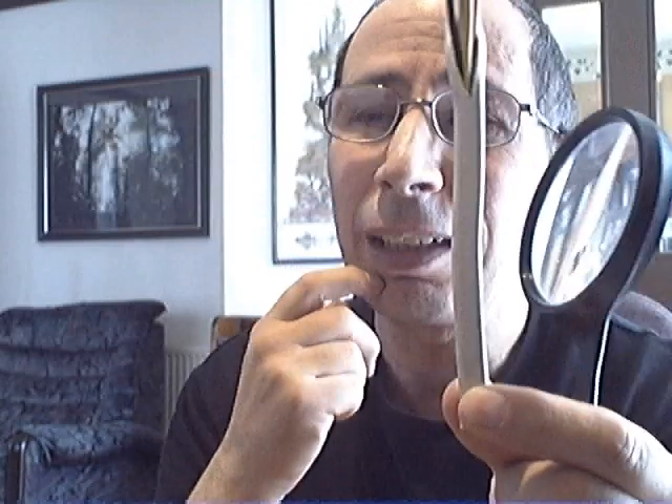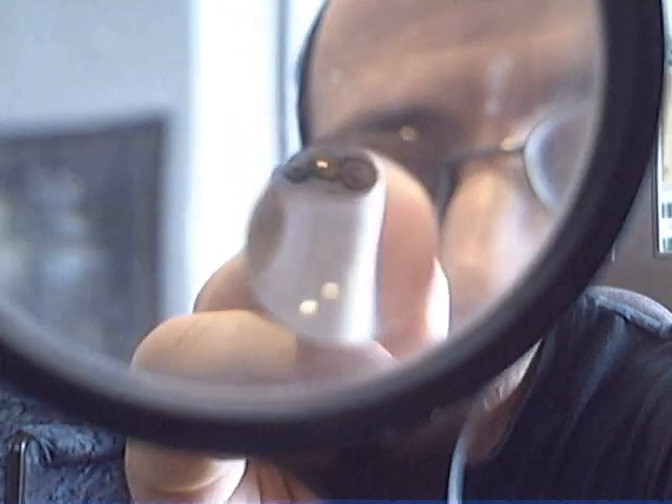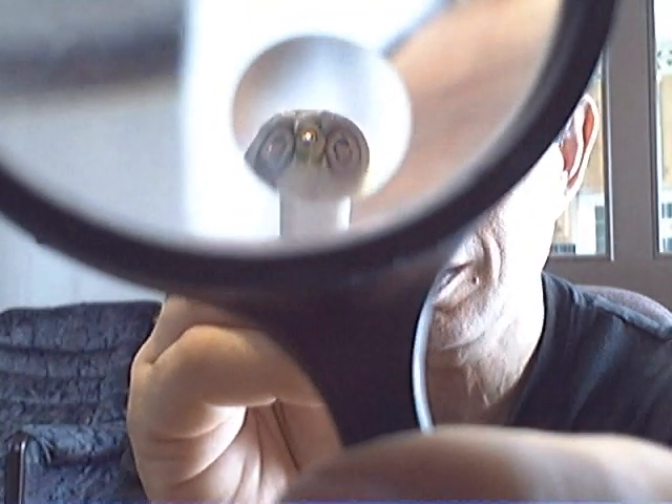Now I can show you this bit, and of course you can say yeah, but you just shoved it all the way down. But even though this piece is quite small — and had I known I was going to do a video like this, because this is seven years ago, I would have got a much longer length of cable to show it. But even shoving this short length down would be quite difficult. Look at the other end — you can see that the earth is insulated. And for those of you who were going to get a bit pedantic about it, the CPC is insulated.